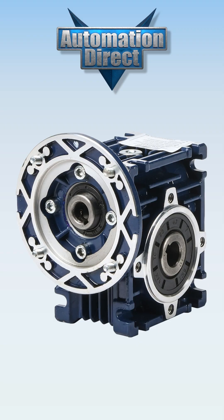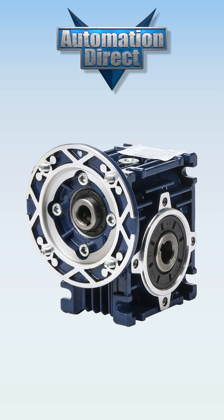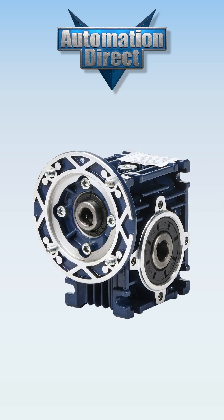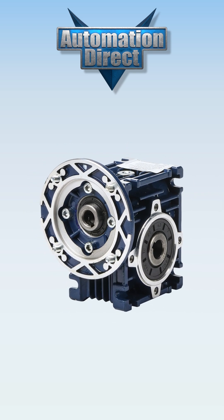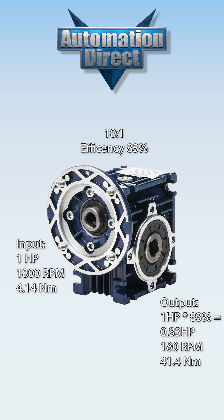A quick note if you're not familiar with gearboxes: also known as closed gear drives or speed reducers, they are mechanical drive components that reduce the drive speed as well as increase the motor's torque by the gear ratio. For example, with a 10 to 1 ratio, the gearbox output is one-tenth of the motor speed and ten times the motor's torque at approximately the same motor output horsepower, minus losses.